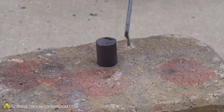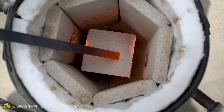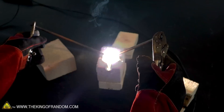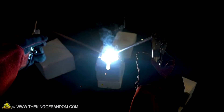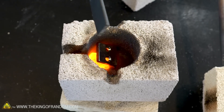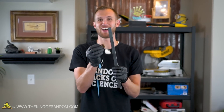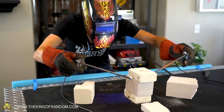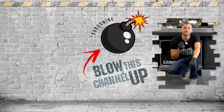Melting metal and magnets really does seem to ruin the magnetism in them. The magnets stop being magnetic when you heat them up too much and they don't get it back after they cool down. Heating up steel over that mark of about 1,400 degrees Fahrenheit causes it to lose all magnetic charge, but when the steel cools down it does become magnetic again. Melting steel into a little blob — I was hoping to put a magnetic field around it, but the magnet heated up so much from the liquid steel that it lost all of its magnetic charge and it's no longer a magnet at all. Maybe someday we'll try melting steel again and letting it cool down in the presence of a powerful electromagnet, which shouldn't have its field ruined by the heat.